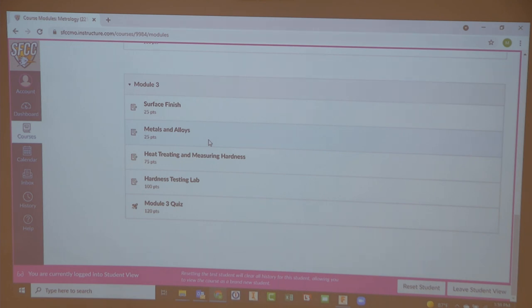Exactly, yeah. Allen wrenches. Over at Maxeon, a lot of their stuff's upside down, so socketed cap screws come out often. They're heavy hitters, cutting through about 5/16 material a lot of the time, and they'll just shear the head off 1-inch bolts all day long from the pure pressure of the stroke. The heads just break off and fall down into the die.